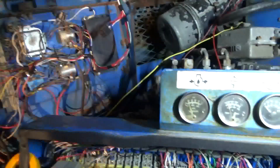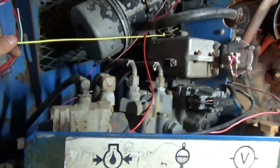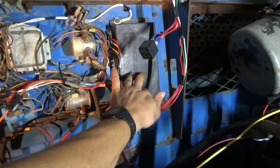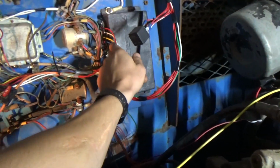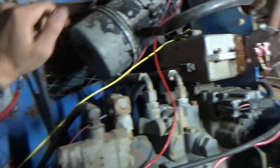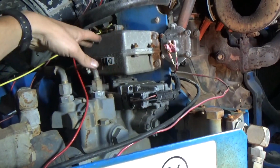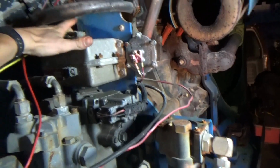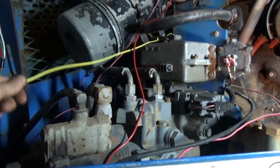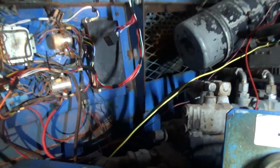Now the last part, the customer's original complaint before any of this crap happened, was this governor. And let's just check what this little box does on this control wire when we raise and lower the RPMs. And if this box works, then the only thing we're worried about is the mechanical, or electrical, solenoid or whatever that actually pulls on the throttle. So just 10 more minutes here and we'll have this thing wrapped up.